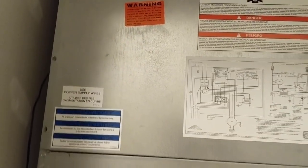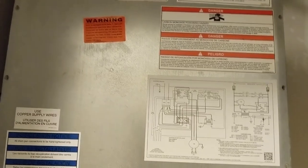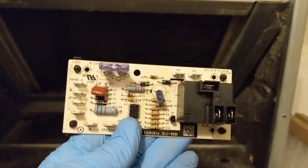There's our indoor blower motor running. The cap was good — it's just the blower board. This relay right here, they're known to go bad. That's pretty much a common work order on an AC when the indoor fan's not working: you come in, check the cap — it's good, thermostat's good, motor's good — it's the blower board. Easy repair, just go wire for wire. Put a new filter in and you're good to go. Thanks for watching, see you on the next one.